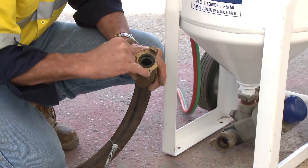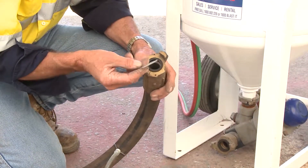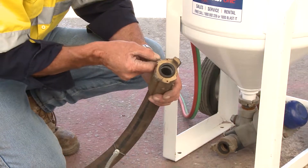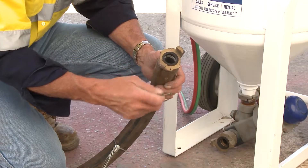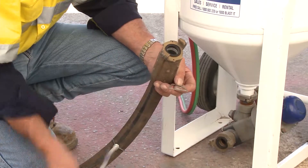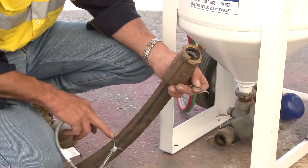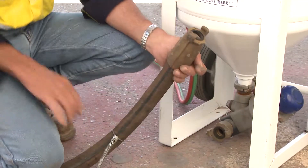It also has two holes in there for a safety clip. Safety clips on this particular item are mandatory. On the blast hose itself, one clip is not adequate — there are two holes, so utilize the two holes with two clips. Clips are mandatory. Whip checks: mandatory. The whip check goes on to the primary fitting and is extended out with no slack on the secondary section.